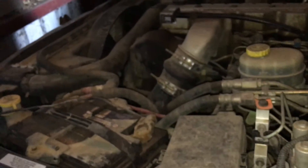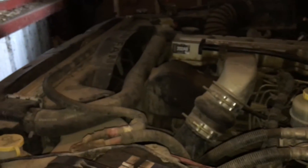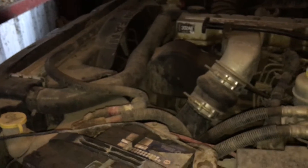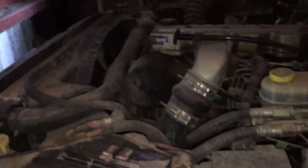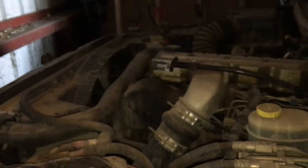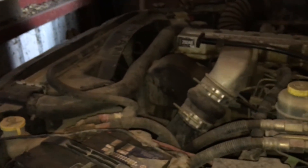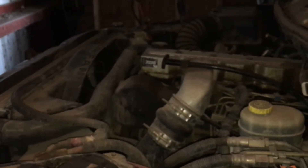The grid heater takes a lot of power too, and it's cold today — about 28 degrees Fahrenheit. It's Thursday and we have a big winter storm coming. The fuel shouldn't be gelled up because if it were below zero it would gel; it's straight number two diesel in there. So this will be a good cold start for you guys. We'll let it charge for a good hour and then we'll put it on boost.